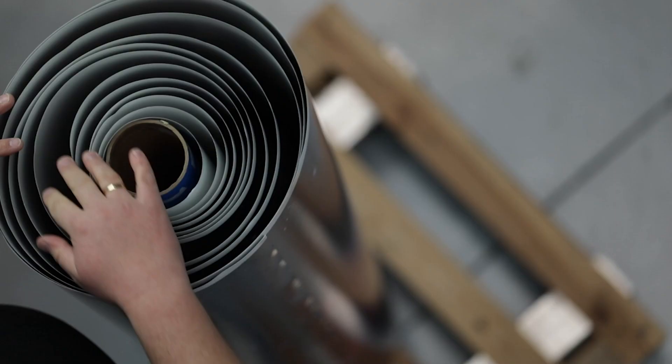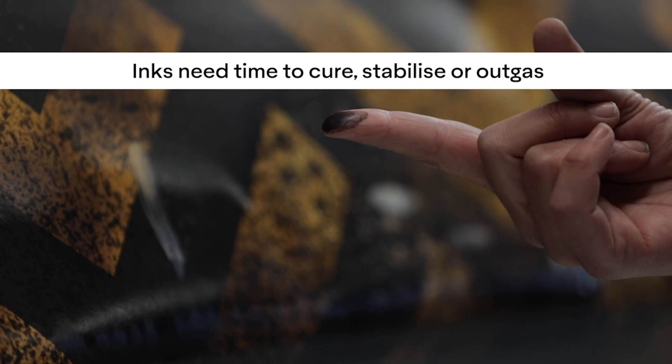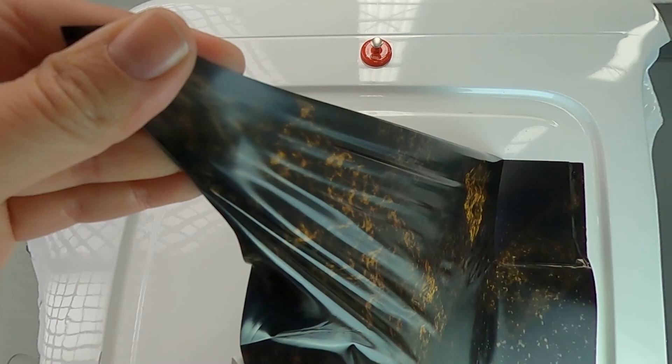Though we're talking about digital printing, it may surprise you to find out that drying is probably the most important thing to get right — and the part that many get wrong. This is especially important for printing technologies where certain components of ink must evaporate. Ink needs time to cure, stabilize, or outgas. Proper drying techniques allow this to happen.